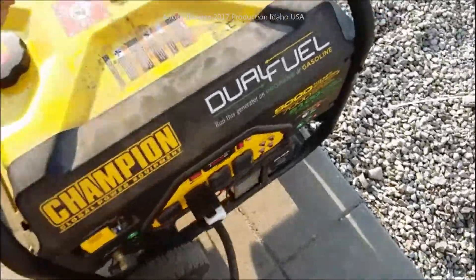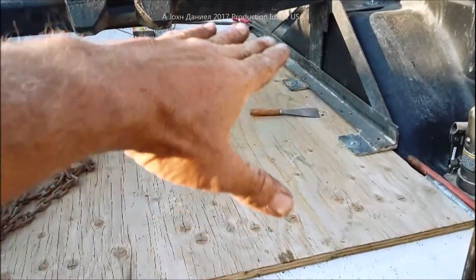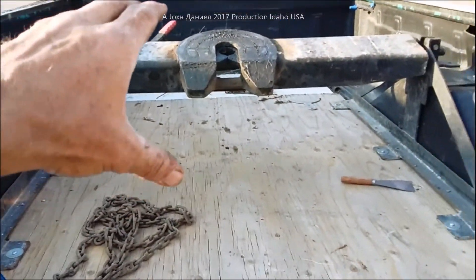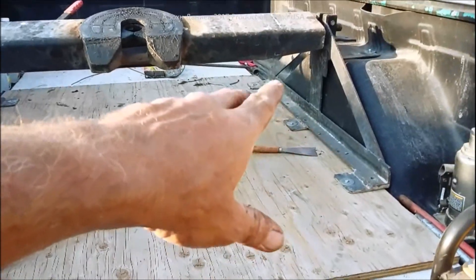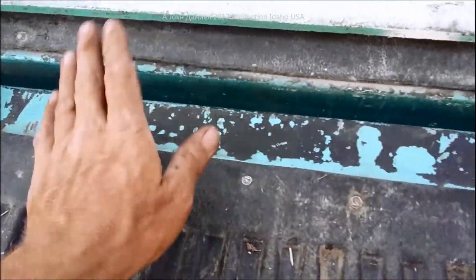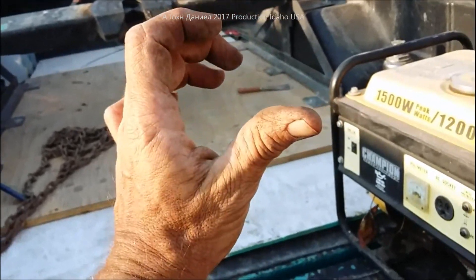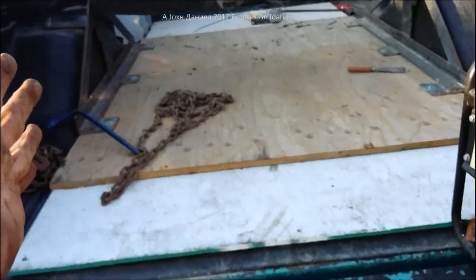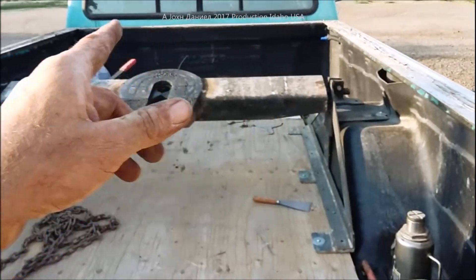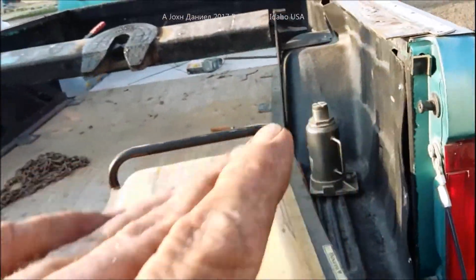Kill the battery power. Now the next move, once that cools down, is to mount it just with some wood screws so I can move the fifth wheel that's got a gooseneck. I'm going to mount it permanently into this frame so I can remove it as I said — the part that came with the Winnebago will be mounted permanently to its frame. I'm going to take all this old plastic bed out, redo the old bed liner that's 20-plus years old, and set it up with cam lock pins that tighten and suck it all down tightly for easy use. My shell is going back on, but this time with actual sliders so I can slide it straight off the rear.